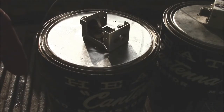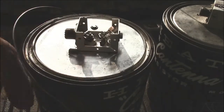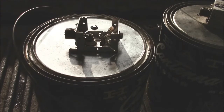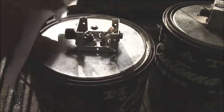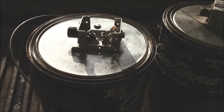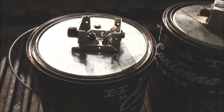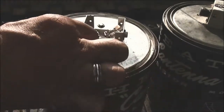Inside there really isn't much. There's a bushing to get you down to the resistor. And all this is just a diode to rectify the RF so you can get a DC reading there. There's a resistor and a capacitor. And someone didn't do a great job of building that — I don't know how you screw this kit up, it's got about ten moving parts.